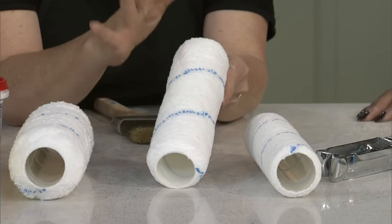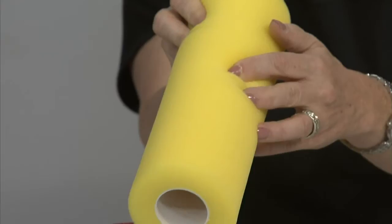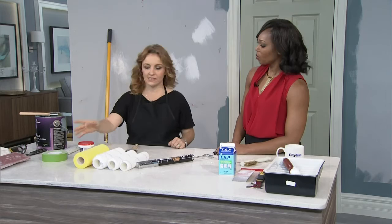The 10-millimeter roller. For matte and eggshell, it's got a little bit of pile so you can put enough paint on, but it's not going to leave that orange peel effect that happens when you use a 15 or 20-millimeter roller. Those are meant for textured surfaces — concrete block or stucco. And if you have really deep stucco, you might even get into these split foam rollers, which really go into the crevices and apply the paint in a more uniform manner. For bricks and heavily textured surfaces like heavy exterior stucco, that's where you want to pay attention to your roller.